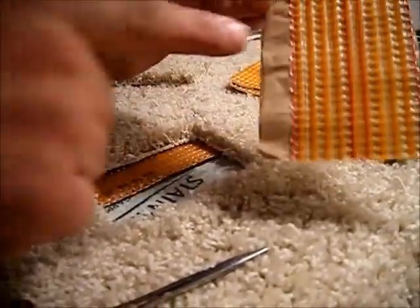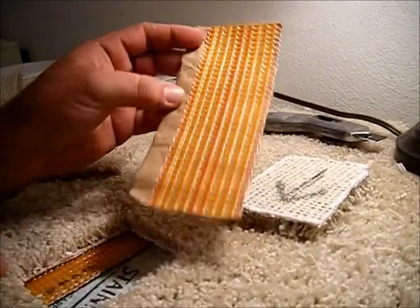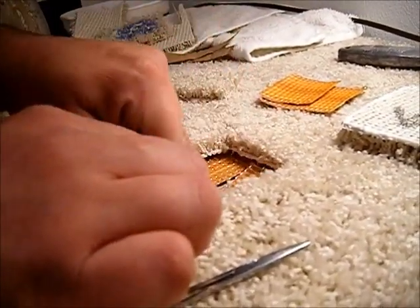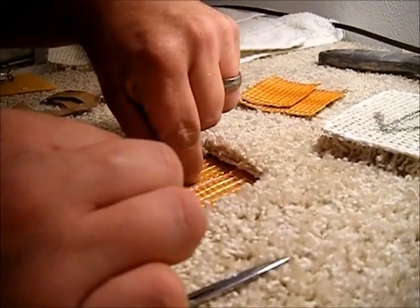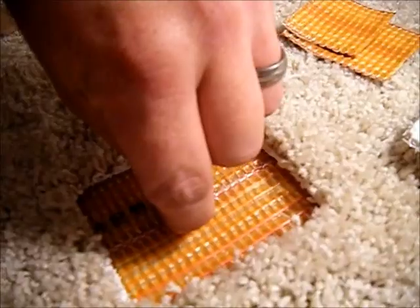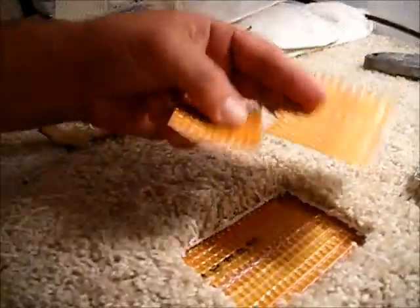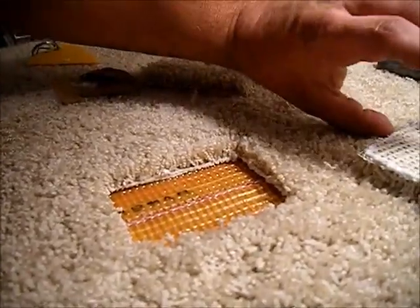There is a red line right down the middle of the K40 seam tape, and that is just indicating the middle of the seam tape. You want about half of your seam tape on the existing carpet and the other half into your repair — we've got that pretty close there. We won't even need the small pieces, but if it was a bigger repair we would use those small pieces to cut in where there would be a void.